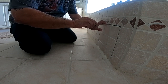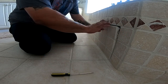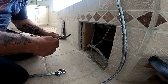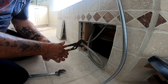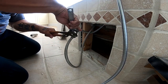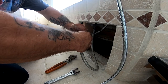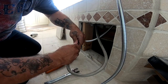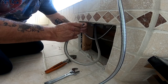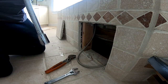Maybe just maybe this will pop out. Alright, now that we're in here I can see there's an extension line much like a dishwasher has that supplies the wand with water. We're going to disconnect the old hose from this extension line and reconnect the new one to it. I'll say this probably a couple of times through this video — before you close this back in, always check that whatever work you did underneath here does not leak. It's imperative; once you close this in you're not going to be able to see any leakage, so test it several times. Now that I've got it disconnected, we'll pull that old line out and discard it so we can hook up the new one.